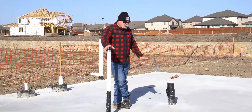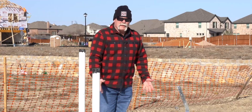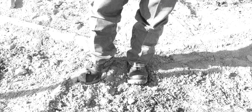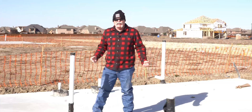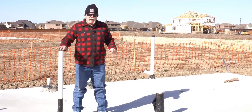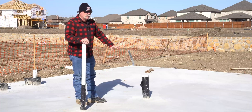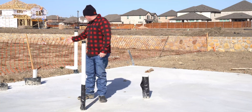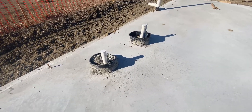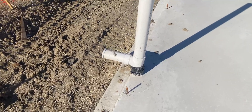Let's head over to the master bathroom. Remember the toilet? Remember the line that I told you is probably for the lavatory? Remember the leak? I'm hoping they got that taken care of. This is probably just going to catch the lavatory. It's the vent for the toilet — that's actually where the flange will go, where the toilet itself is. Back here behind me we've got a tub and shower in the master bathroom. Then the last line on the house — and I love the idea of putting a clean-out on the end of the line.